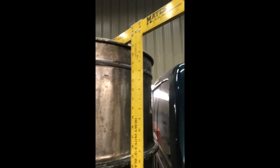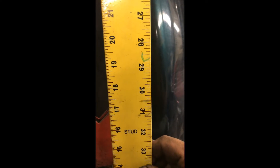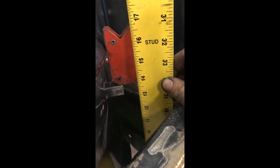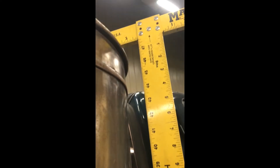So I've got a drywall T-square. I set it in place — I have that just magnetized right now. I've already traced it out where I want it. I use the T-square to bring it out as far as where that pipe will be sitting — you can see the pipe is right behind it, it'll be sitting right there. I'm square up off of the top, and I've got about three-quarters of an inch clearance on my thickest part. So that'll work.